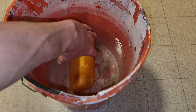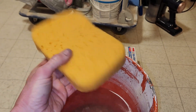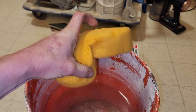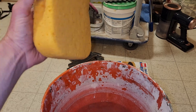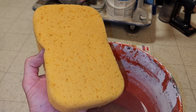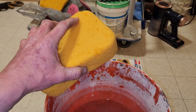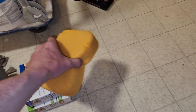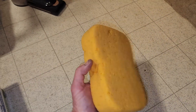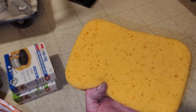We're going to use similar 45-degree angle passes with the sponge. Because these are hexagon tiles, I'll do some circular motions going against the grout lines. If you have long rectangular tiles, keep the sponge moving along their length so water doesn't pool in the grout lines — too much water will strip the color from the grout. This is our first wash. If you have a helper, definitely cycle out your water because this black grout is making the sponge and water absolutely disgusting.